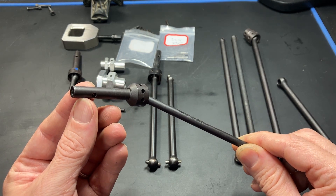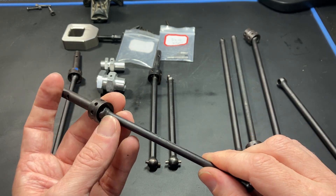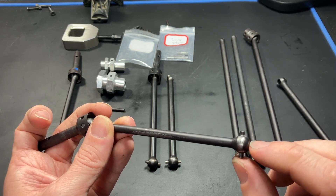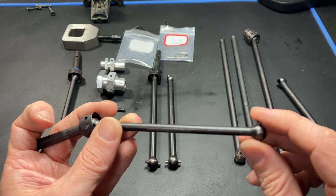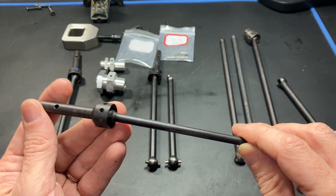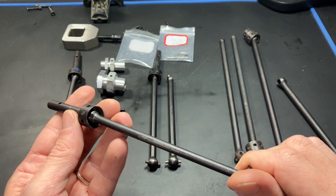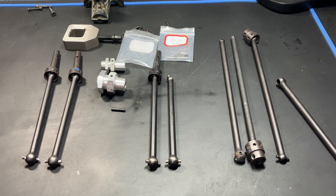I'm hoping to do a version 3 with all the revisions. I will make this thread shorter and have it start lower inside the shaft. I will reduce the radius of this area so it doesn't make contact. I will add a thread here with an M4 set screw and then make custom pins with a flat section so the pin is captured. I'll keep the same diameter here and might reduce this area a little so it doesn't make contact — but other than that it's close to where I want it to be.